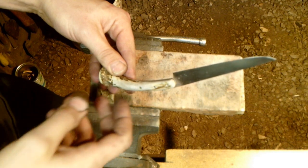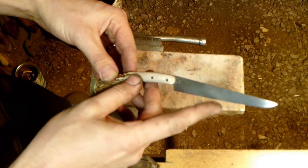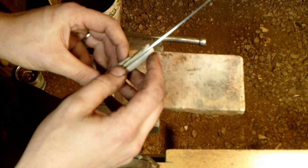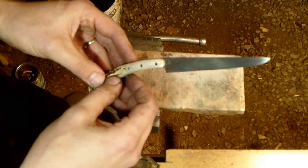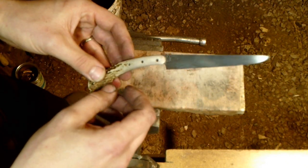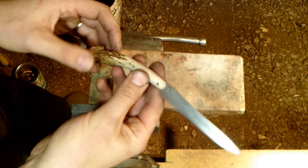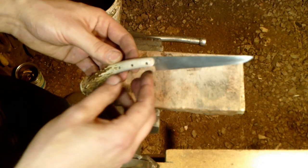At this point I've got the antler all filed down, sanded, and contoured nicely, and the blade is pretty much at its final finish. One area to be really careful to get finished is the round transition where the handle meets the blade, because after we install the blade that's really hard to sand. I've sanded down the antler with 220 everywhere I wanted, contoured everything nicely, and taken care of the butt end as well. Now it's time to talk about setting our rivets.